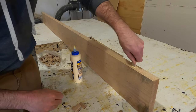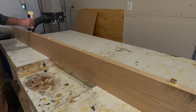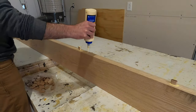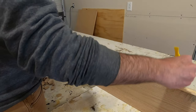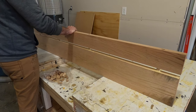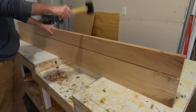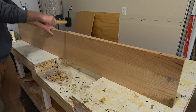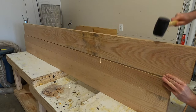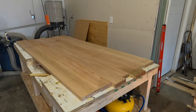The mortise and tenon system with the domino works really well. You just pop these into place with a little bit of glue and then those mortises cut on the other board will be lined up and they slide right together perfectly. Now this works fine and it does help everything to be aligned very well, but the time it takes — especially using all the dominoes — I just don't necessarily think that this is worth it. I can usually get a better glue seam if I just lay all the boards down on the clamps and then just clamp them together with a lot of pressure. But in this build this is what I did, and I actually wouldn't recommend this if I was redoing it.